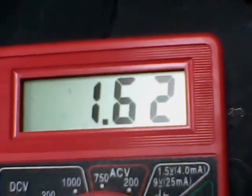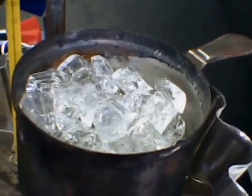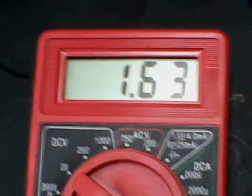What I'll do is hook up three of them on an aluminum block — a water-cooled aluminum block with sufficient length to fit three TEGs. I want to stop this at 150°C. Closing in on 150, 1.63 volts. Look for my additional uploaded videos — the next one will have the three in series.